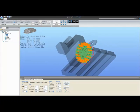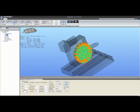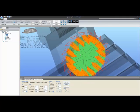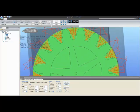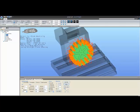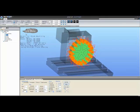And again, you can see its orientation. Remember again that if your orientation is not this, you can change it in the options menu to have the face of your chuck face in any direction that your system might have it in. Tangential bit will probably be the most used option for most people. So let's take a look at what happens. You're going to find that with the right selections, you'll get pretty much perfect involute teeth, just as before. Let's look at some of the other options, though. All you have to do to switch to another gear, with your project screen on the screen, is just click on one of the other gears or one of the other objects.